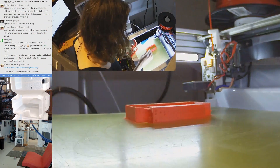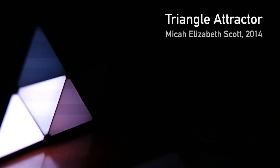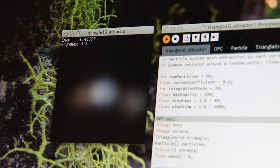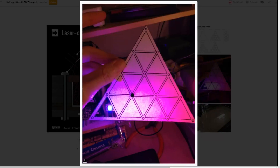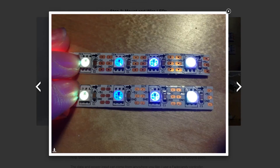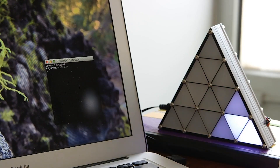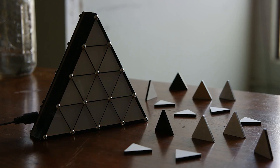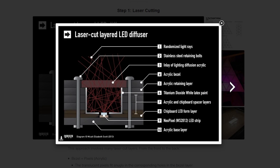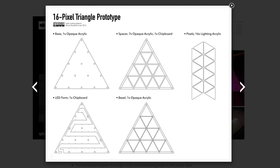Here in the Bay Area, we have a ton of incredible makers. One of them is Micah Scott, also known as ScanLime. She recently published a tutorial on Instructables for making this LED triangle made of smaller triangles. It's a project that involves laser cutting out a frame and the acrylic triangles that diffuse the light. Inside the frame are a handful of NeoPixel strips wired together so that power and data wires run out the back to whatever project board you want to use to drive them. Micah goes into some useful detail on how the design creates just the right amount of space for diffusing the LED glow — the only way to get this kind of even glow from just a few LEDs is to get really smart about how you diffuse them.